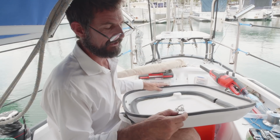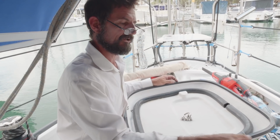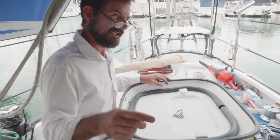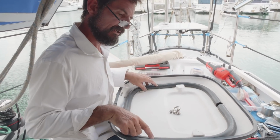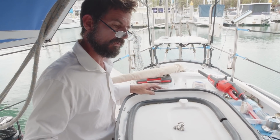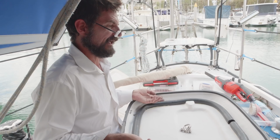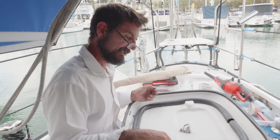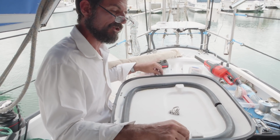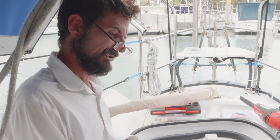And then of course this black rubber here will be really UV resistant, and it mostly presses to the deck, but there's a couple of bits where about a toothpick fits under it. That's not bad, because if a big wave comes aboard, it'll slow it down enough that this will be able to deal with it, and any water under there should be able to drain back out. What we had before was a soft seal, and the water would force its way under the seal but couldn't escape back up, so it would build up enough pressure inside our hatch that when the next wave came in, it would jam it past the inside seal. So it was a bit of an unexpected thing. We actually had to put little tubes there just to break the seal of it. Trying to keep the ocean out is a challenge.